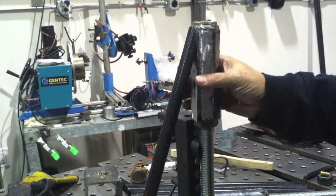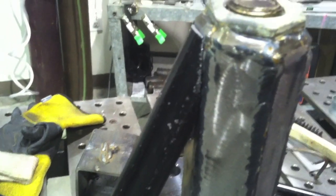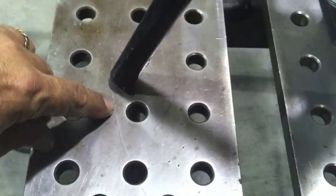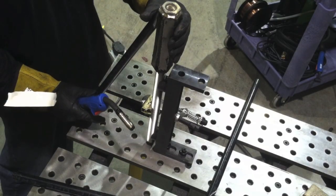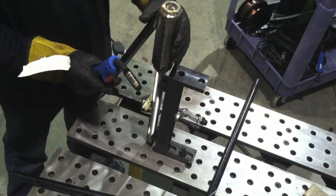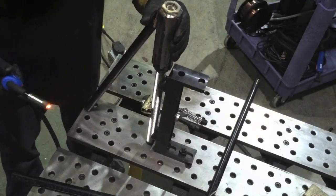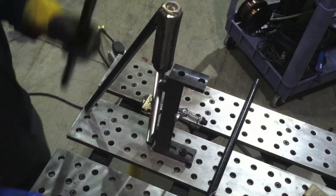It fits pretty good. Having six sides on the hub gives me flat sides to line the legs up to, so I didn't have to worry about coping like I would with a round hub. The pipes wind up just about right to the outside of the circle, and now I can tack them all up. I probably should have drawn a triangle within the circle to space them precisely, but going by how they looked coming off each flat side of the hex, the end product turned out just fine.